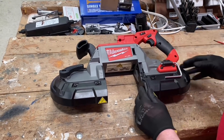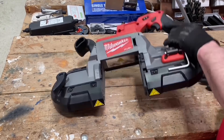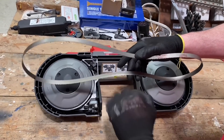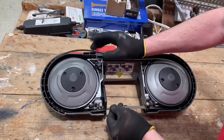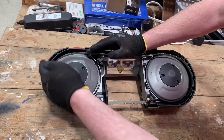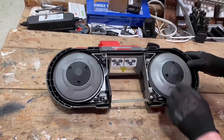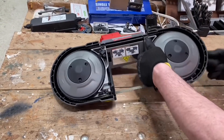It's always a challenging moment when you have to put a blade in a new tool. Release the left-hand side, move up the guide, flick it over. This arm here moves in and out of this section, which puts the tension in the blade, so you'll need to have it untensioned when fitting a new blade. Top tip: teeth go downwards. The blade goes into these two little clips — push them firmly into position first. I've just pulled the top blade down so you see it bulging out of the sides, then just lay it into position. Obviously it's sharp, so be careful and wear the right gloves.